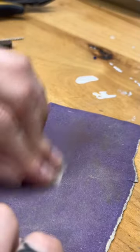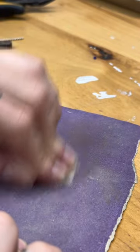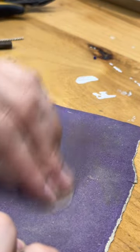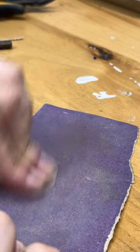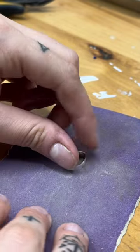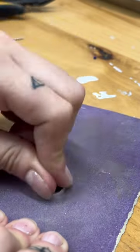I really like to sand things as I go. The next step is to take a piece of 220 grit sandpaper and sand the major scratches out of the front and back of the back plate that you just cut out. I use that same piece of sandpaper to also sand the bottom of the bezel so that it lays flush against the back plate and offers a cleaner solder joint on the finished product.